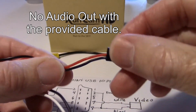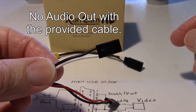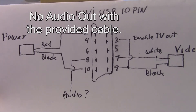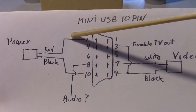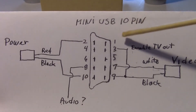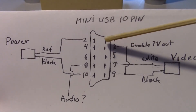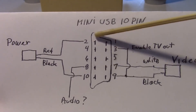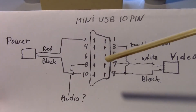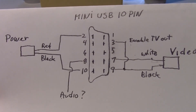One thing I've noticed about the cable is that you have voltage and ground to energize the camera, and video and ground, but there's no audio that I could tell on the cable at all. So I've drawn a little schematic that shows the diagram of how the wires go. The red and black wire that you can use to power the camera are on pins 2 and pin 10 — this is a 10-pin mini-USB, which is different than most USBs that only have 5 pins on the mini-USB. So the audio supposedly comes off pin 8. I haven't tried this yet and haven't proved it, but that's where it supposedly is.